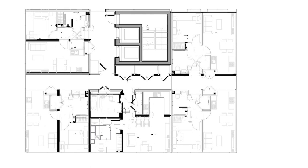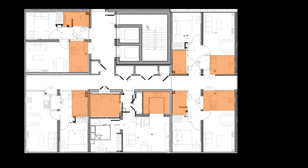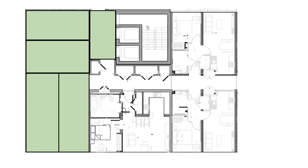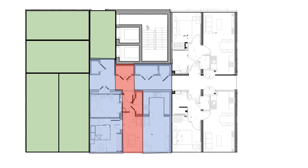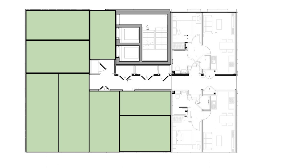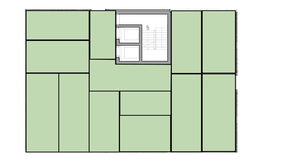When we get an architectural layout, first we determine which parts of the building are required for traditional construction, such as the stability achieved from the core. We identify areas with high levels of finishes, such as kitchens and bathrooms, which in particular benefit from factory-level finish. We look at the layouts to maximize the module size that can be lifted by cranes or fitted on site, and minimize the site finishes. There are usually numerous ways to break up the modules, and we always look for the simple solution — ending up with one stepped module around the core to complete the layout.